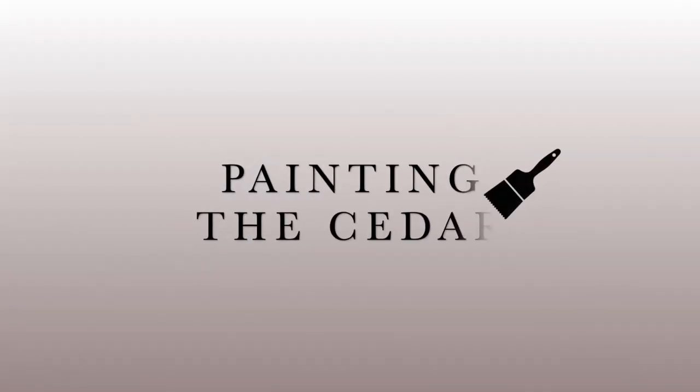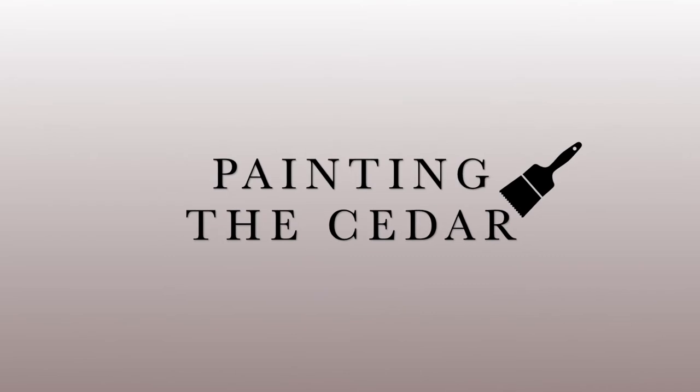Let's talk about the painting of the cedar — we definitely learned some lessons along the way. This cedar is not sanded down; it's very porous, so we knew we were going to have to do some type of primer to prep it for the paint and make sure it was sealed. We did have some trip-ups with what type of primer to use. Ultimately, we tried to avoid oil-based primer, but in the end it was just the only thing that was going to get rid of the staining and work on a bare wood surface like this. Save yourself some time — if you've got unfinished rough wood you're going to be painting, just use oil-based primer.